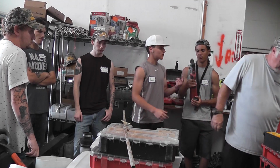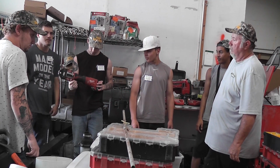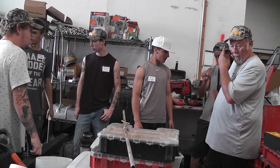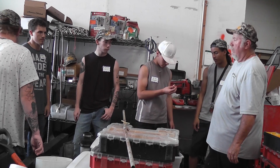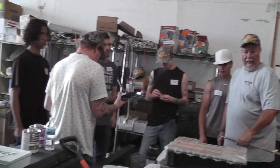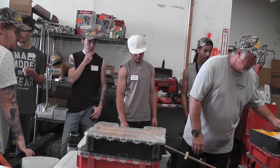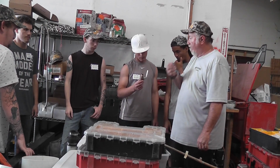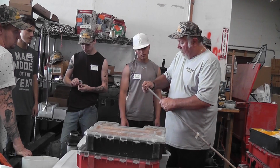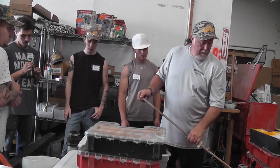This is what they call a ProPress. The fitting, if you look inside, you'll see an O-ring. Yep, that's a coupling. If you're working for a company that has any salt whatsoever, they'll have a ProPress system. So let's say we're on a job and I can't get the water to go down. What I can do is take the ProPress. I'm not going to put a valve on here because it wastes time. Couplings aren't that expensive. Pop that little bugger on there. Gotta make sure you don't have any burrs on this little pipe.